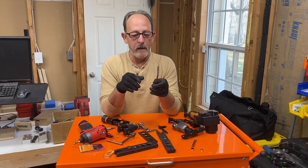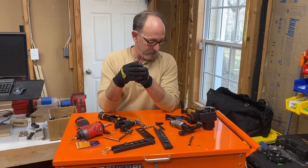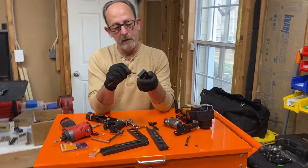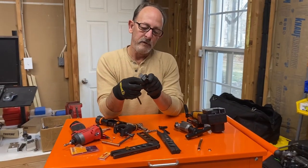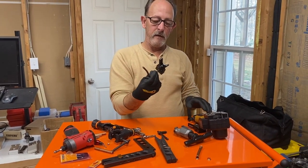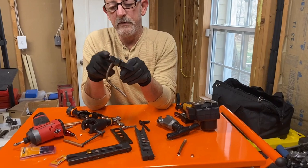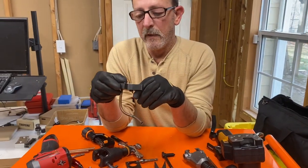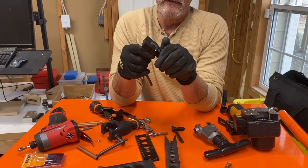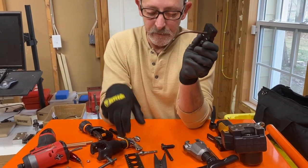All right, so people ask about 1/4-inch copper, how good this actual tool does. So we're gonna try it. I've already deburred it. I'm gonna push it up against there, push against the stop. People's biggest mistake when they first start using this is they want to grab hold of both sides, or they don't push it up in there deep enough, and their flares are always too small.